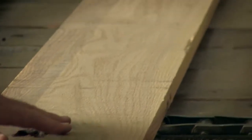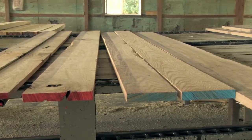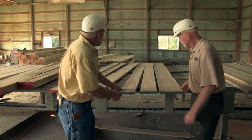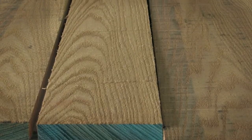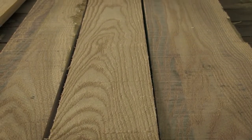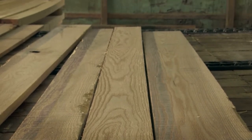But you can see the overall quality is not as good. As you can see on these other boards — these are the blue ones, off the good log. You can look down those boards and see that there's good clear, no knots. These are the money boards; these are the boards that buyers want to buy. I can pay about two to three times more for this log than I can for that log — just because of the yield, the quality, it goes through the mill easier, debarks easier, all the way through. The main thing is the quality is so much greater.